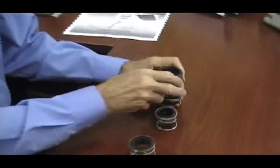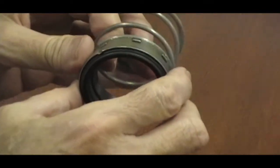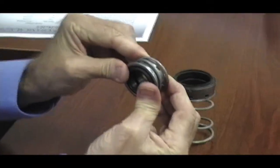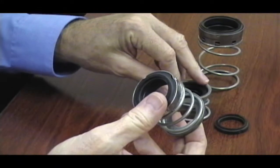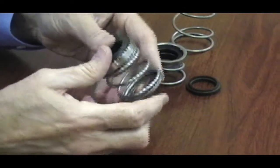The type 1 has a long working length and a narrow cross-section. It'll fit into very narrow stuffing boxes as long as there's enough length. The type 2 has a very short working length. The type 21 has a short working length, generally about the same as the type 2, and it takes up a little less space. It's become the most universal seal.